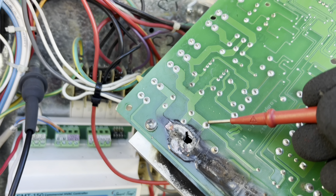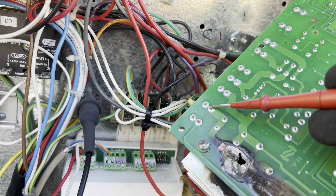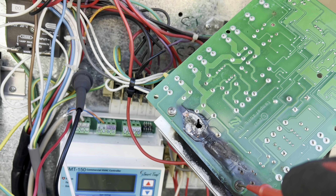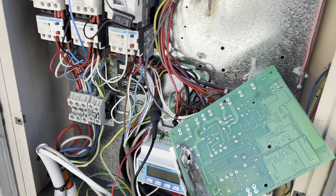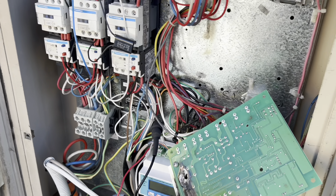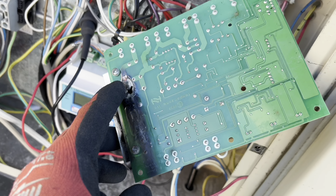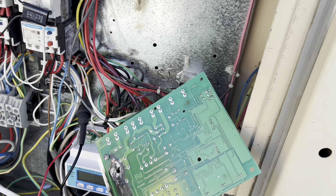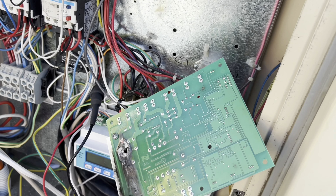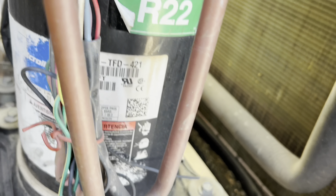Nothing on my input supply side. I'll keep going through and see if I get any direct shorts. As it stands I've tested everything — all the motors — nothing's coming up with a reading to earth. The fact that our breaker has also tripped — I've seen boards blow before that just take out the control circuit breaker here, not the actual mains breaker. So I am leaning towards a surge. Electrically I'm confident to say this unit is okay, so we'll just have to order a new board, come back and do some more testing.